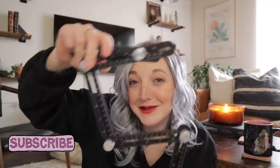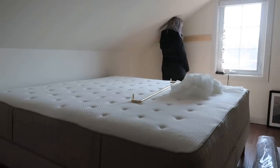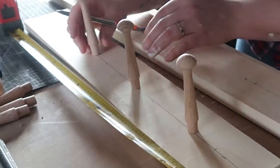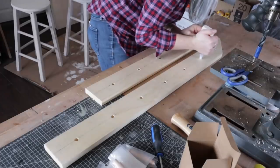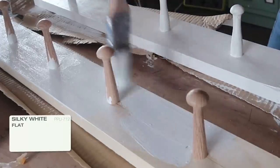You can make a W for Wonder Woman, you can make an S for subscribe — help me get to 200,000, please. So I had my angle and my wall measurement, and like any shaker peg rack I've built on this channel — which has been many times — I cut my board on the chop saw, walked back to the bedroom for a dry fit, and yes, it's good to go. I then measured and marked out where I wanted my pegs to be, normally eyeballing it first, then adjusting using proper math, and used my drill press to drill my holes. To finish it off, I filled the holes with wood glue, hammered in my shaker pegs with a mallet, and finished it off by painting them the same color as my bedroom walls — Silky White by Behr in flat.